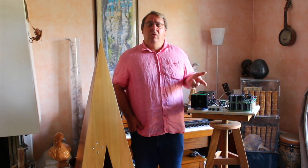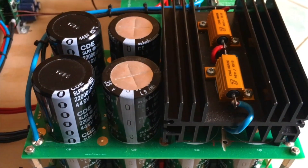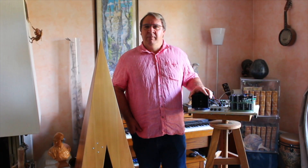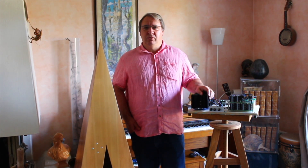One of the important aspects of this amplifier is that it will be modular, receiving up to three optional modules. We will find an AirPlay module, a Bluetooth module, and also modules for specialized studios — such as XLR with high-quality transformers, either Jensen or Lundahl. The base connectivity will be a 6.35mm Jack and two RCA connectors, which will be used to manage the two channels.